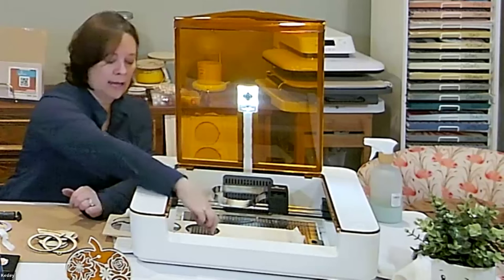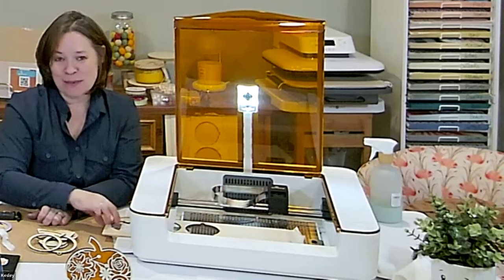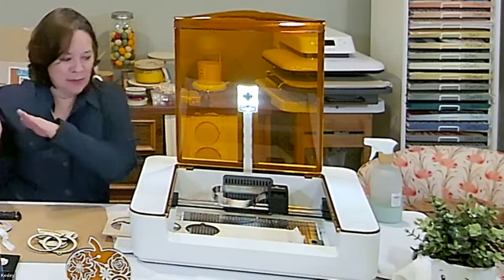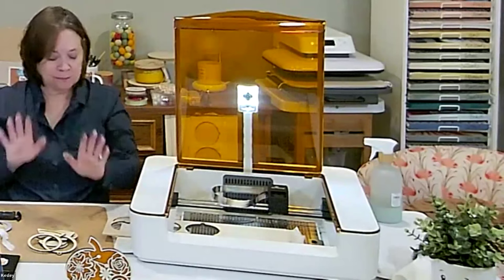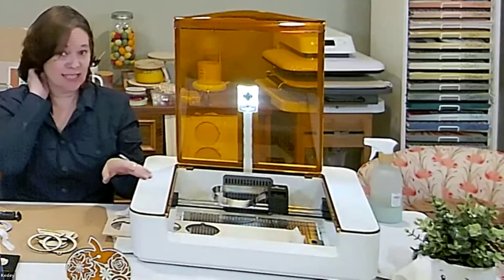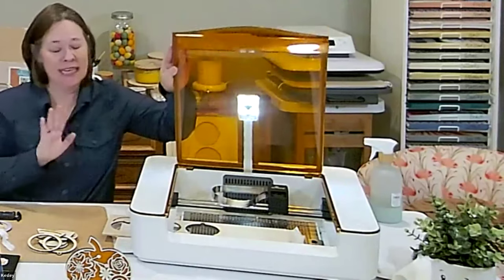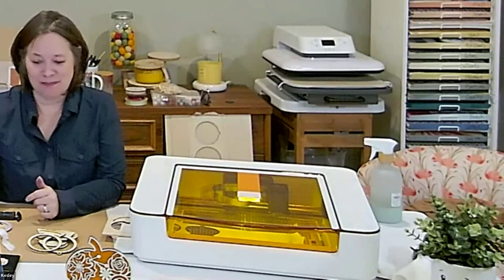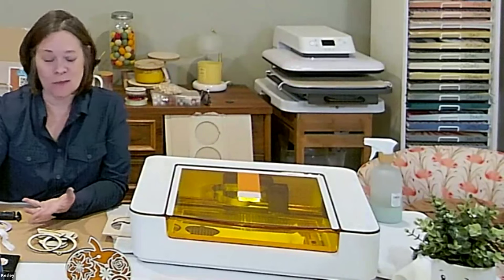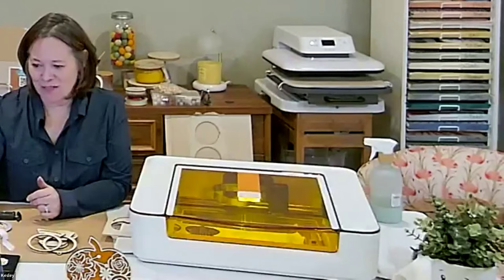You can also make little pins that go in the hex grids to hold your wood down. I like to use the doors because when I put my wood in and bring it out the other side, it really holds it down flat. The first couple of times you may have trouble with that until you figure it out. Even now it still happens to me that it won't cut all the way through — I think a lot of times it's because my wood is warped or I didn't have it held in place.